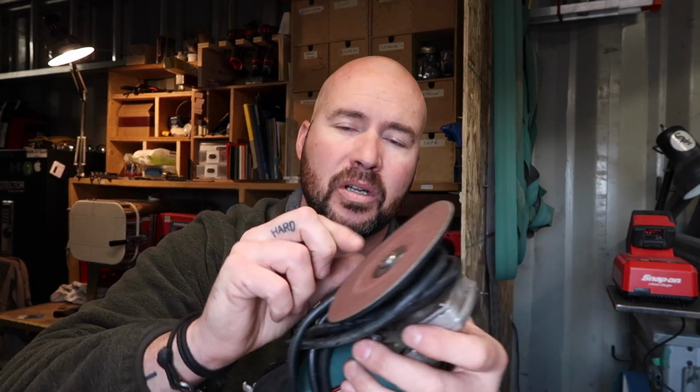So that's this week's edition of Tool Time Tuesday, and for all those that have requested the angle grinder stuff, hopefully this gives you some of the information you were looking for. There's not a lot to these things, but really watch your RPMs. Make sure that what you're going to put on the grinder is rated for the speed your grinder can run at. Number one, most important rule.